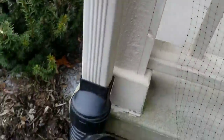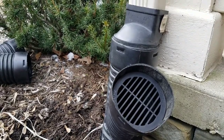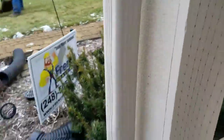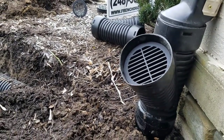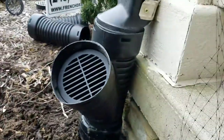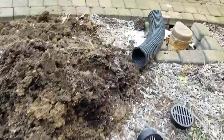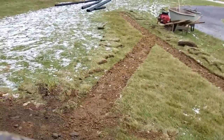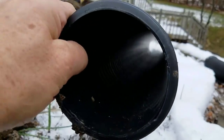Here's a trick that we use: we vent the downspout here. This works really, really amazingly — you're going to pick up a lot more speed. Velocity is key; velocity is what you're after. It's a gravity-powered system. When the water falls off the roof down into this underground drainage system, you don't want to lose the velocity you've picked up. You don't want to lose it to a poorly vented system. You don't want to use single-wall corrugated pipe — you want to use dual-wall. There's your single wall; you can see the valleys inside it. You'll lose velocity due to those valleys. On a short run or a run with a lot of pitch, it doesn't matter — they work great. But we have a long run, so we're going with the smooth wall.